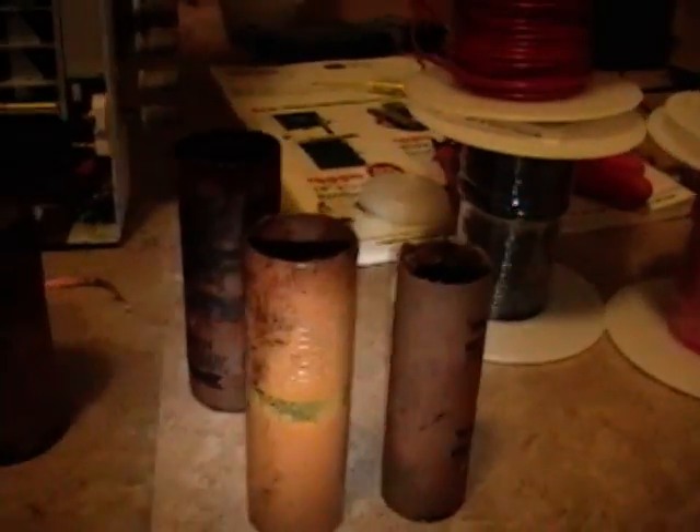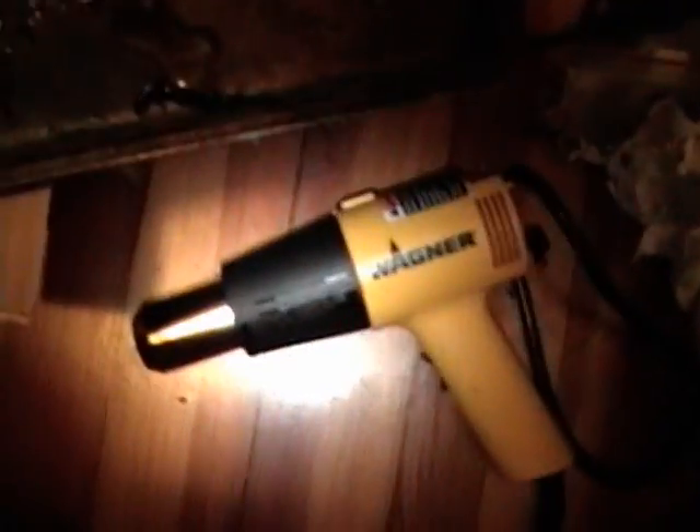The next thing to do — I want to reuse these tubes if at all possible — so I used a heat gun and a glove. I held the capacitors by their wires and heated up the tube, which softened the wax, and then I pulled these out while holding the hot tube with a gloved hand.